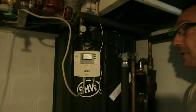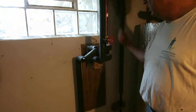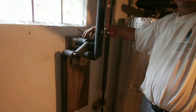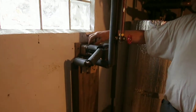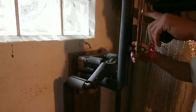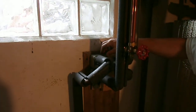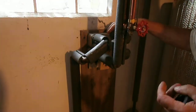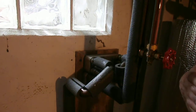The other advantage of this water heating system is that we have the opportunity to use some of the excess energy in the wintertime for boiler water. The water is coming in through the outside loop and follows the path to two different flat plate heat exchangers. Because we have a glycol — a non-toxic antifreeze — we're not worried about contaminating the heat exchanger. Groundwater can contaminate a flat plate heat exchanger, clog it up, and make it less efficient. We are using a glycol-to-glycol loop, so there is no opportunity for minerals or buildup in the heat exchanger.